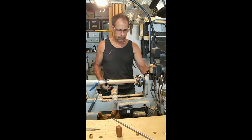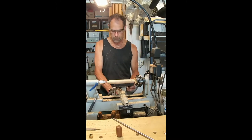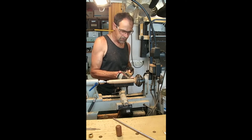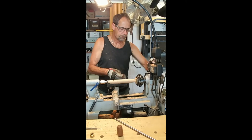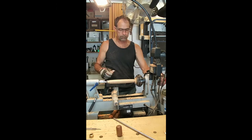You want to try to do all your smoothing using your gouge - if you use sandpaper it's not going to cut uniformly. We'll sand a little at the end, but we want to get our nice contour with the gouge rather than grinding away with sandpaper. We'll just run a little sandpaper on that to take splinters. I like that. I think I want to round that little corner here just a bit, and I'll do that with the parting tool so I don't have a sharp corner on the back end.